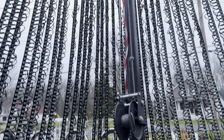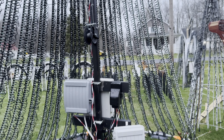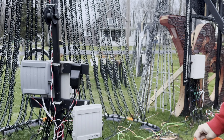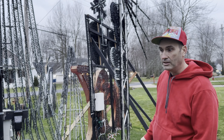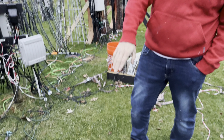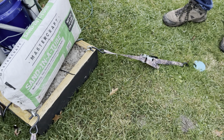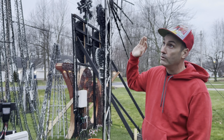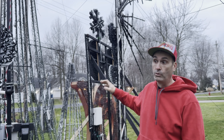Before that, this thing would just flop around — now it barely budges. We're only using two outlets on the house to run pretty much this whole side. There are a lot of wires everywhere; I made a lot of them myself — pigtails, cutting ends, splicing into 16/3 power cords — with a lot of dielectric grease throughout. We also have 18-inch stakes in the ground and ratchet straps to keep these from going both ways. Over-engineer everything — pay the extra — and you'll be glad when stuff doesn't topple over or break.